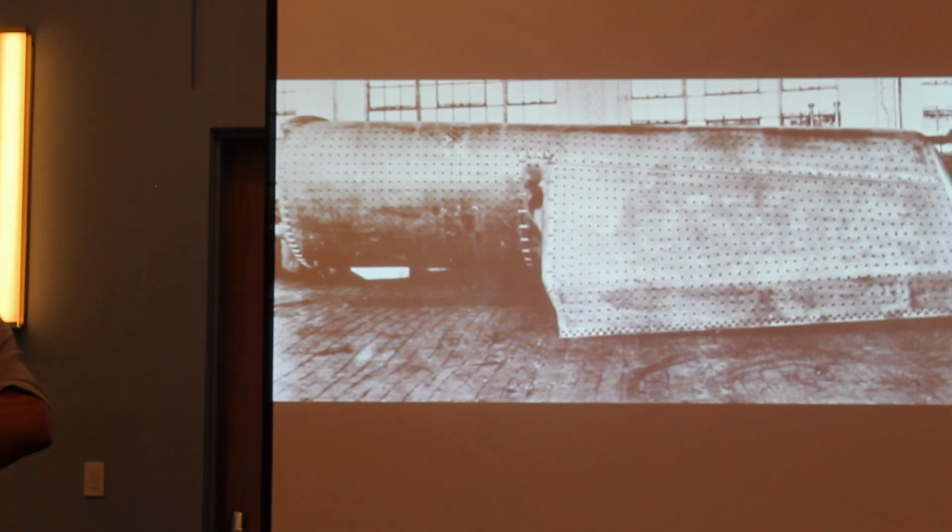Now, typically, boiler tubes corrode and they don't do so well. The lower the barrel, bottom of the barrel, the quicker those tubes start to deteriorate. The higher you go, they're in better shape. So that's why they make you take them out the bottom. But when it did come time for taking all your tubes out, typically a lot of the tubes on the upper portion of the tube pack were in good condition, as long as they had good water treatment.